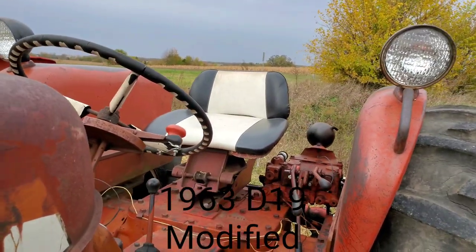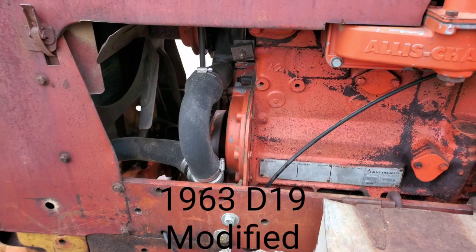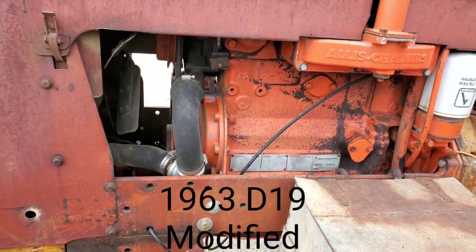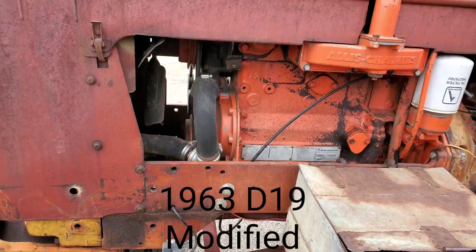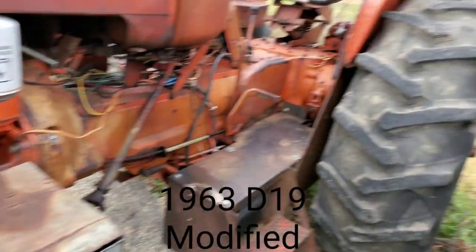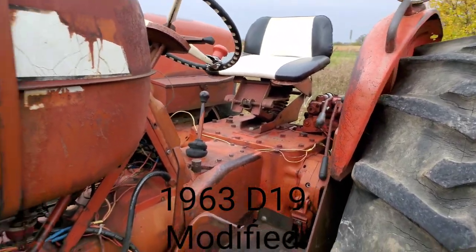Spool over here is broke, but I don't care. Over the winter, it's going to be getting live hydraulics, 190 pump out here. Since this came off of a combine, I gotta switch the timing gears to hardened timing gears to be able to run the pump. A couple day project. But then it's going to have hydrostatic steering, live hydraulics. I don't know, I'll probably just get rid of that spool. I haven't taken the time to fix it yet.